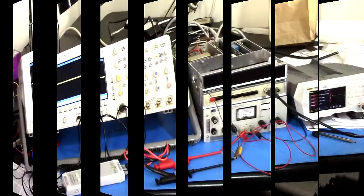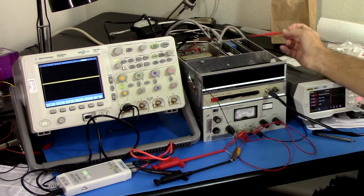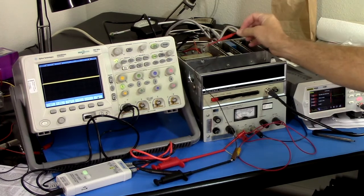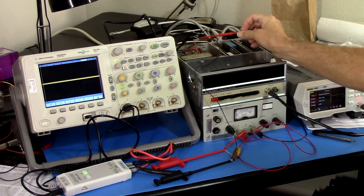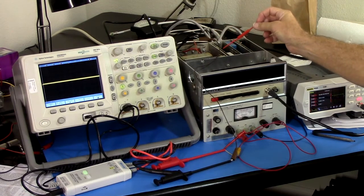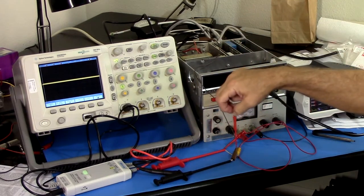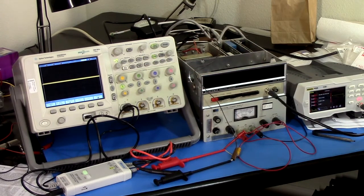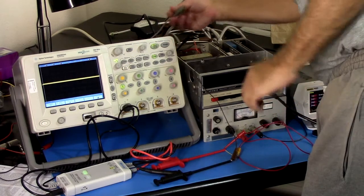So how to deal with this? All right, for my next attempt at making sense of this thing, what I've done is I've soldered the input board's power feed to the voltage regulator, and I've got the power feed to the multiplier board coming from this power supply. And that's hooked up through my little 0.1 ohm resistor so that we can look at it over there and try and see which board is causing the problem, I guess, is what we're trying to see here. I do have to plug this in.